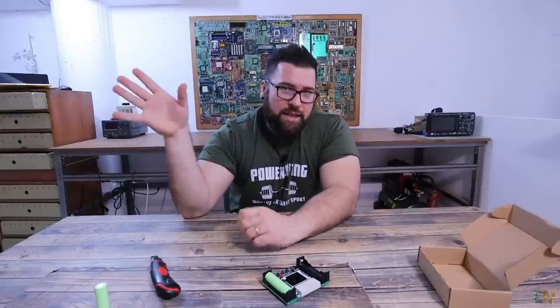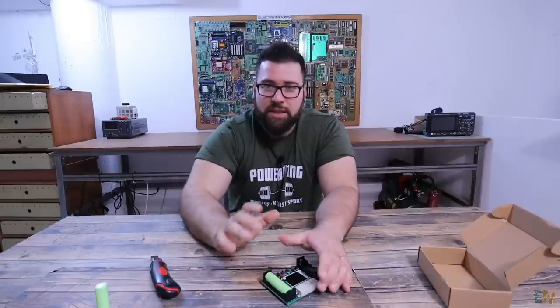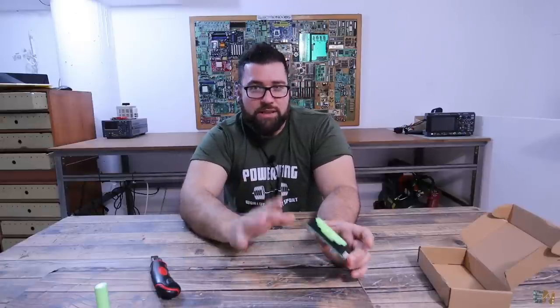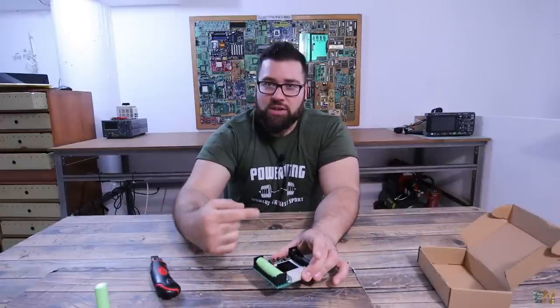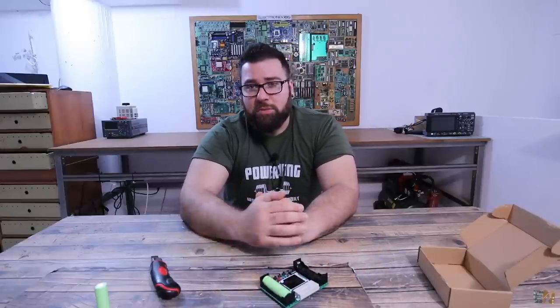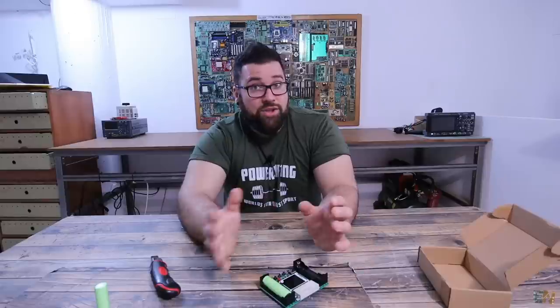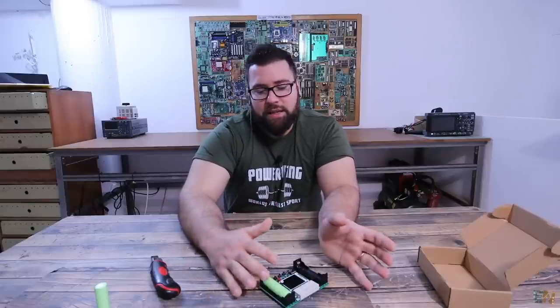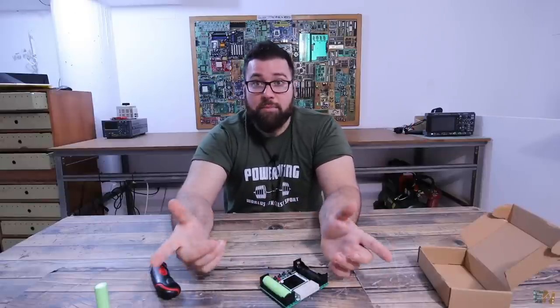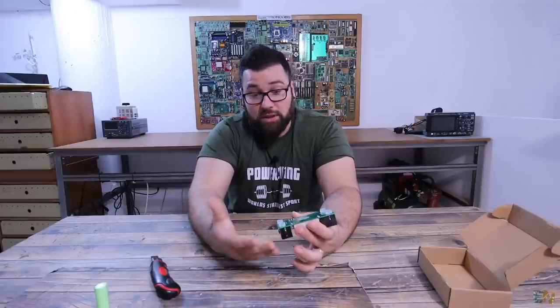The PCB is already in design, it's not final yet. I still have to make a few tests with the charging process, because if you want to charge only one battery, it's easy. But if you want to charge more than one battery, they will share the ground potential, and that could be a little bit difficult, because it will be like having a balanced charger of 3S, but instead of 3S, it's just 1S in parallel. But anyway, that's why I bought this PCB, to compare with my project and to learn from it.